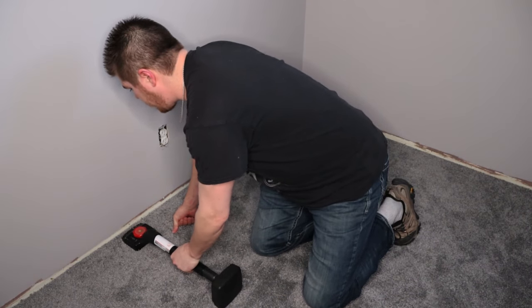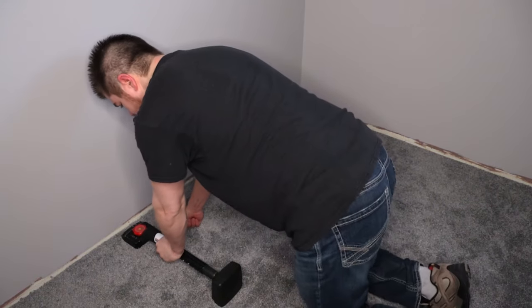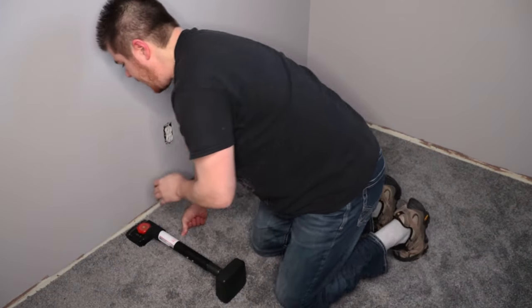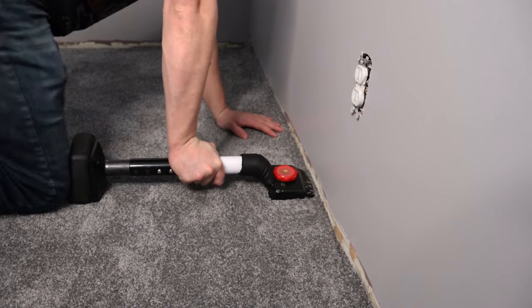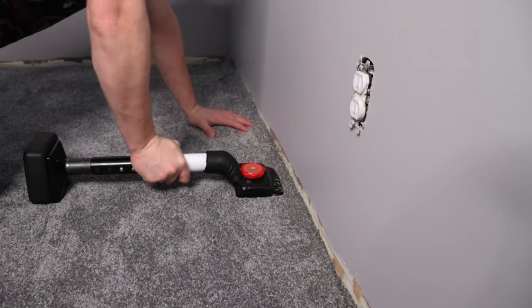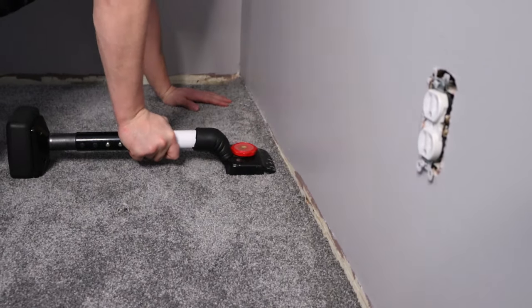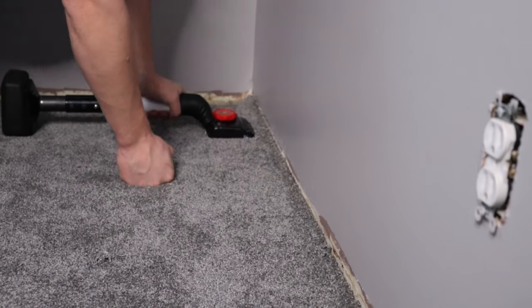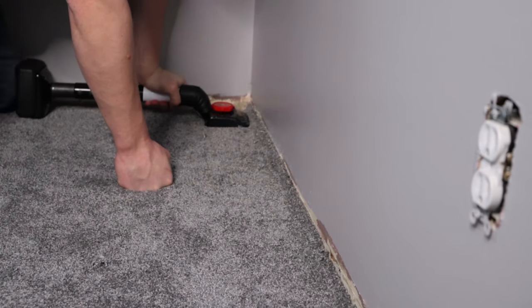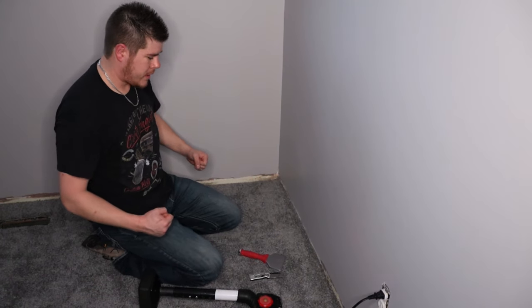Slide it forward and actually lock it onto the tack strips — that takes out any of the slack in the carpet. Once you've gone around the entire room and stretched all the carpet out, give everything a quick inspection and see if there are any parts that have lifted up ever so slightly, and just give anything that needs it a good kicking again until everything is smashed and kneaded and pulverized into place.